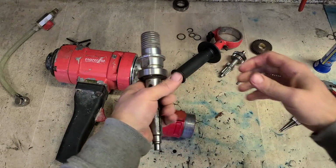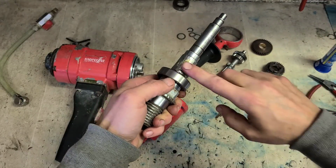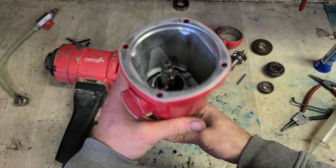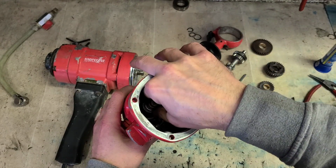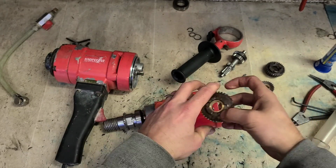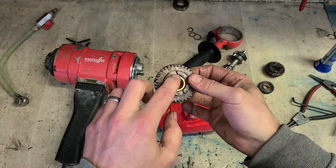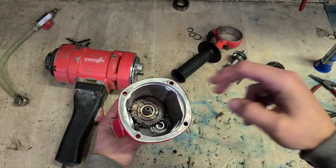Now, awkward, but I'll put a bit of grease on there too. Some in there to help hold that keyway whenever we're reassembling. Now, put that shaft in. Put on your shim first. Before you install your shaft fully, stick this gear on. So that has to be sitting at the bottom, with these wee lock sleeves sticking up. Drop that on.